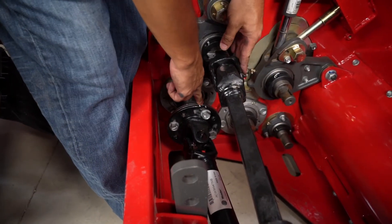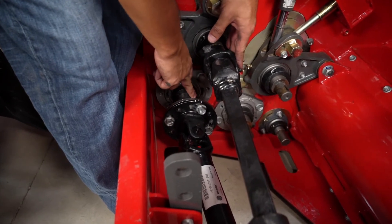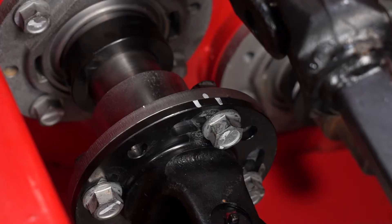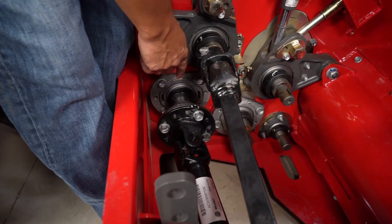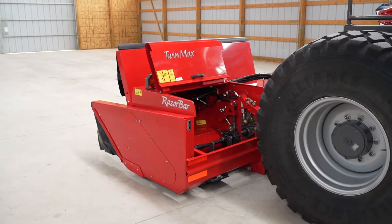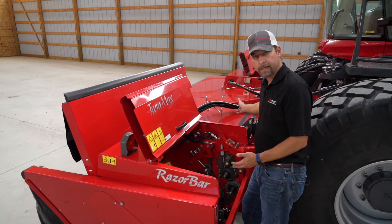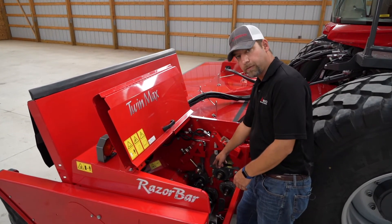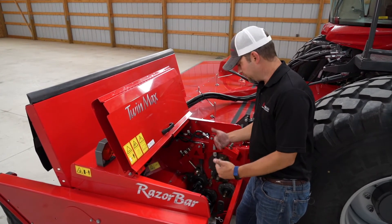You want to set it in the middle. This is the part that's moving; this is stationary. You've got the back and the front — set the middle, then tighten these back down and you know you're in time. If you want to be a little more aggressive, sometimes you can move this a little forward depending on your crop conditions and how you like your crop crimped. Now we've come around to the left hand side of the header. We've already set the timing on the rear rolls on the right hand side. Now you set the timing of the front rolls on the left hand side. Loosen those four bolts, mark your tolerances on both sides, and set it in the middle unless you need a more aggressive crimp.